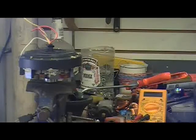But we put the other 7 magnets in. That should do something. And by the way, they are the really cheap ceramic magnets. But one thing I did learn is by putting in half the magnets and all of them north inside, she still produces. So when I get ready to get this video together and get it on YouTube, I'm going to go ahead and place the order for those other magnets. It's $63 for 10 of them, and we only need 7. They pull 58 pounds a piece, so 7 of them will be right at 406 pounds of pull. That ought to give us something.